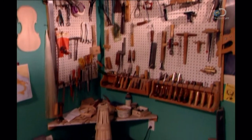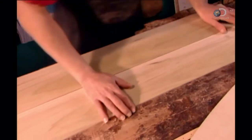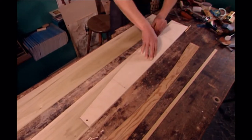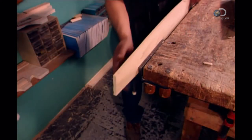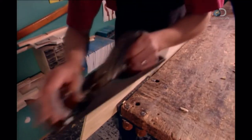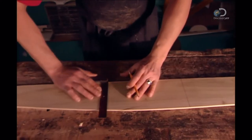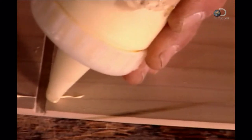The sides of the sound box are called ribs. They're made from 7mm thick pieces of solid poplar. The instrument maker traces a rib-shaped template on the wood, then cuts out the shape using a bandsaw. He clamps them onto his work table, then with a plane makes them symmetrical. Now he draws three lines across each rib to mark where he'll cut slots — we'll see what those slots are for later on.